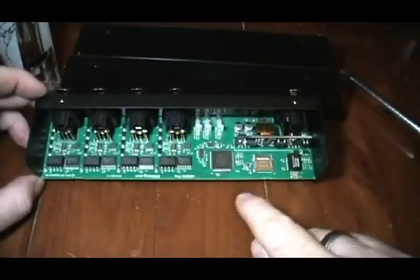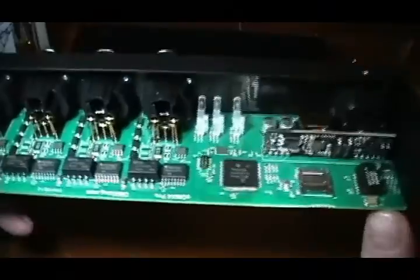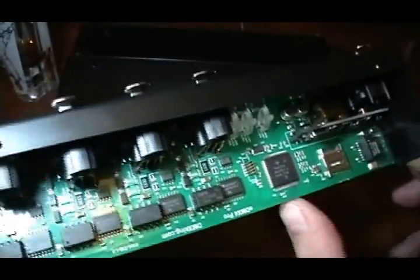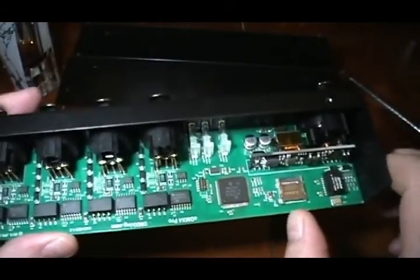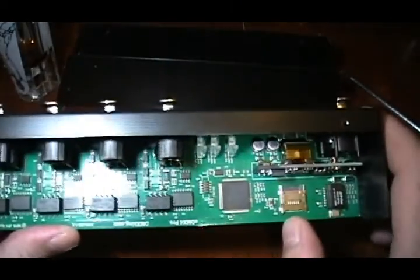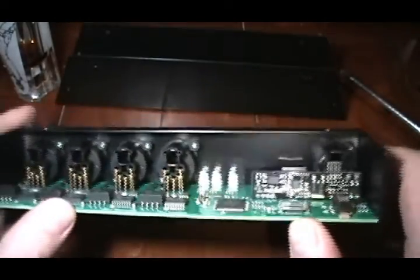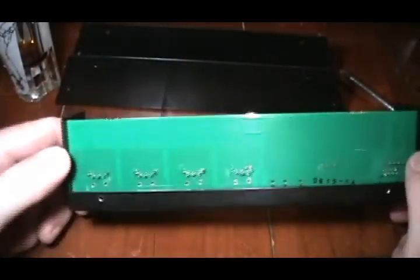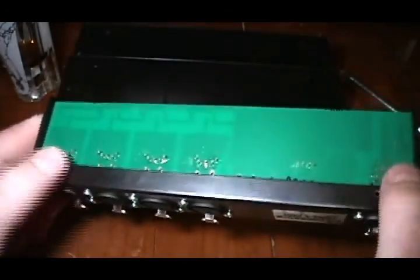I'm really surprised about the SD card slot. I wonder what's going to go in there. There's really no point putting a card in there because I wouldn't know what the firmware would be expecting — if anything. It might be used for updating firmware or at the factory somehow. These connectors are so cheap — probably two cents to put on the board, so why not? Nothing on the bottom — completely unpopulated. Big copper areas for isolation, to catch any stray RF — that's nice.